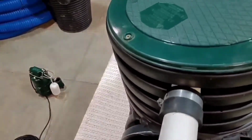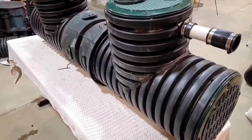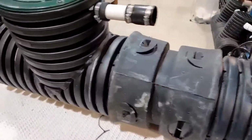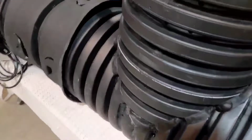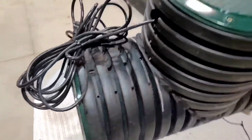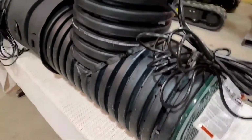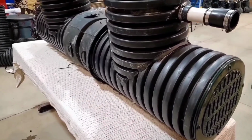This is a first. A duplex lift station, fully plumbed for the DIY and contractor to put in any situation that demands a lift station sump pump system. This is not indoor material. This is not a cheap, flimsy basin. This is heavy dual wall culvert pipe. This is custom welded, custom made with an extended horizontal chamber that'll give you 80% less cycling of your sump pump, extending the life of the sump pump system.